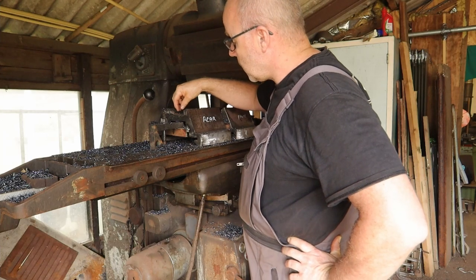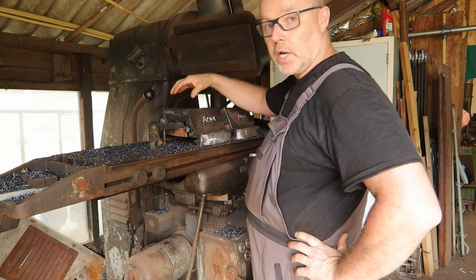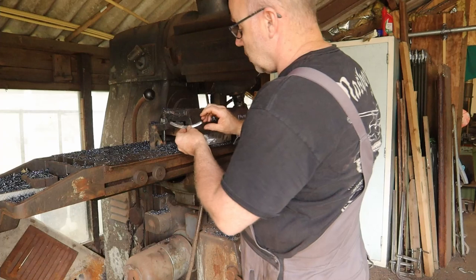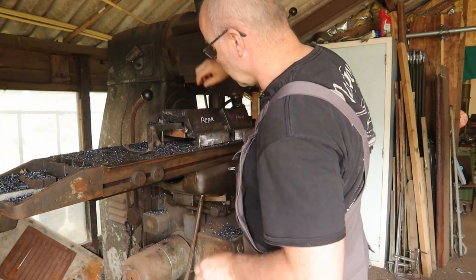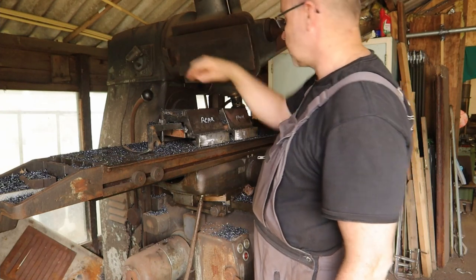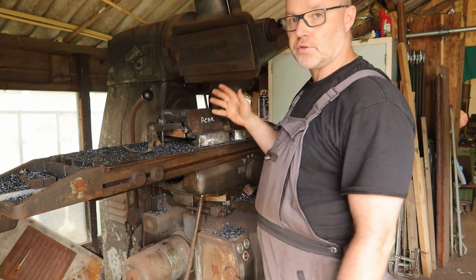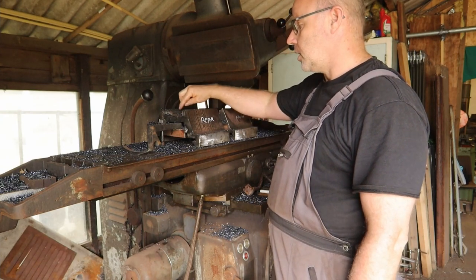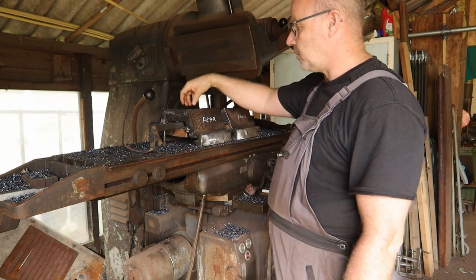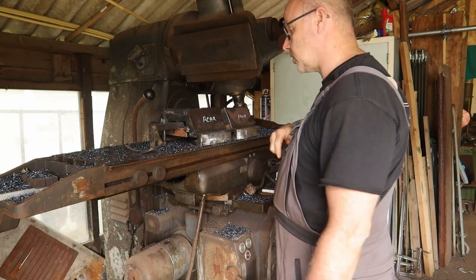But what I'm gonna do now, mill to the correct depth first, and then see what I need to change to get the correct curve. I'm making another piece of the same curve, and then I'm gonna line it up with the two corners and scribe it on both ends so that I have a line to mill to. And then when it's really close, the last bits of transition from one milling lane to another, the milling passes, I can grind out with the angle grinder with the sanding disc, so it's not really a problem.